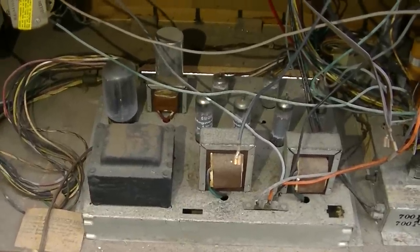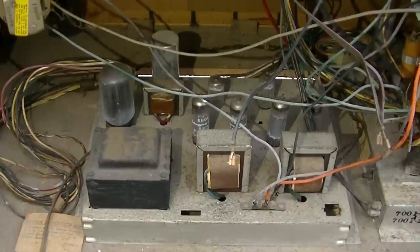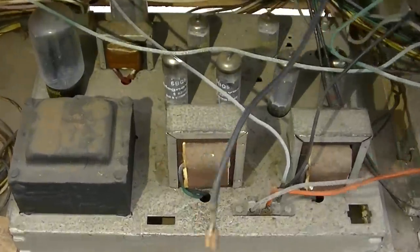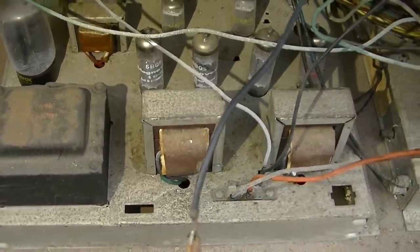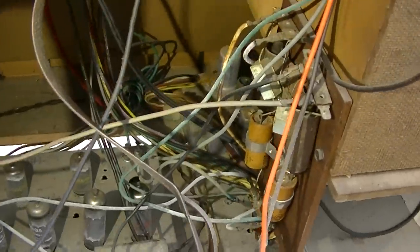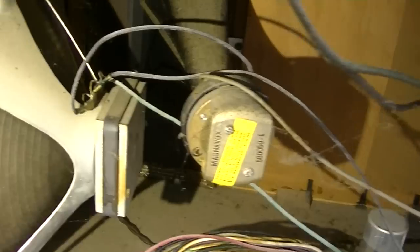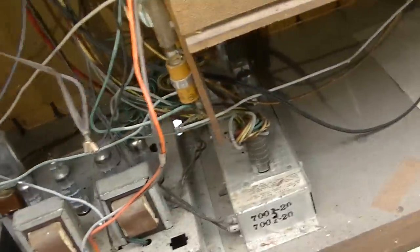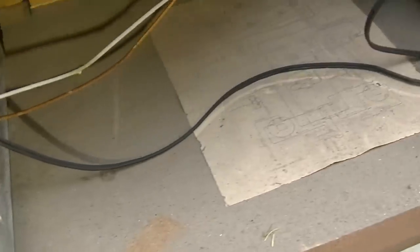Wow, look at this. This amp is worth more than the whole thing, probably by a factor of 5. Two 12AX7s, four 6BQ5s. Look at those nicely sized audio output transformers for, you know, a kind of a console stereo. It's not hi-fi, but we have the crossover network here. We have horn tweeters. Maybe not tweeters, but high-end. Nice big horns. What are those, 12s? Looks like over here, this is probably the stereo multiplex decoder add-on chassis. Another nice size horn, 12. And then up here is the stereo tuner.